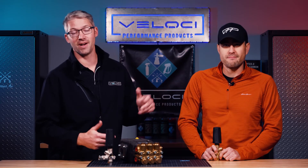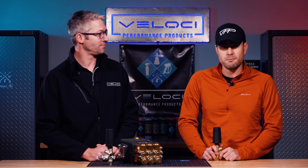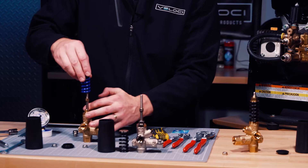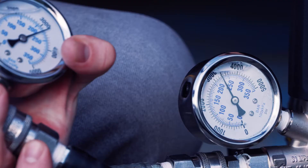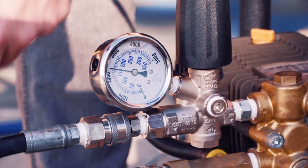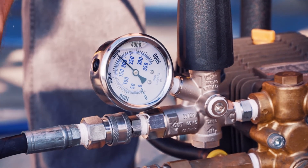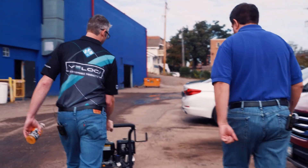I've got Kyle here — he's the eyes behind the camera — and he's got a couple questions about why we ran into issues. You may have noticed our pressure gauge was only reading 2,000 on a 4,000 PSI machine. Mike, why was our unloader not working properly? Good question. We had swapped from black to blue spring and then back to black, thinking there was a variance in the pressure. It was a new unloader, so it could have been that. At that point we realized it had to be the pump, so we went over to American Pressure and they helped us diagnose what the issue was.